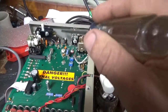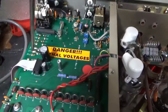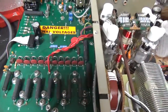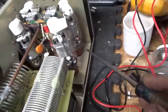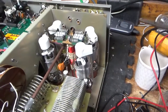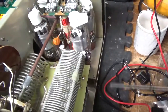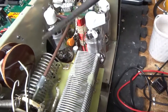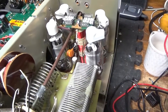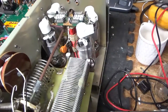Some people hook the key line up to it by accident and put a dead short on it. I cleaned the soft start relay, reconfigured the buck boost, tightened hardware on both sides, checked the meter protection diode, added gas discharge tubes, and installed a brand new set of Pentalabs 572B tubes — awesome company, great customer service. Fixed a solder joint, compressed the coil, and checked the variable caps — no arc damage.